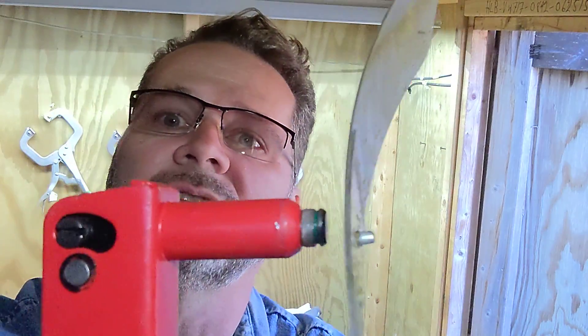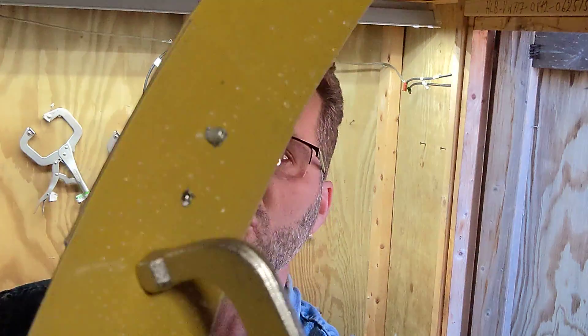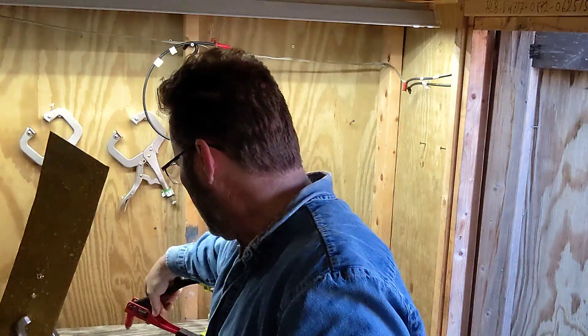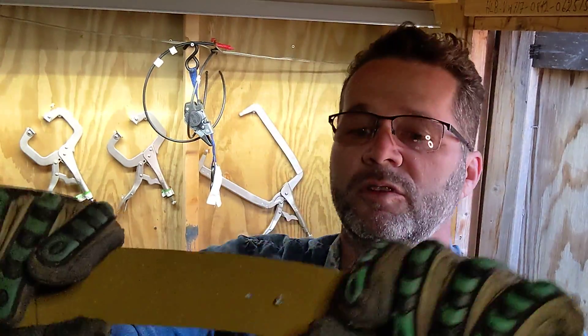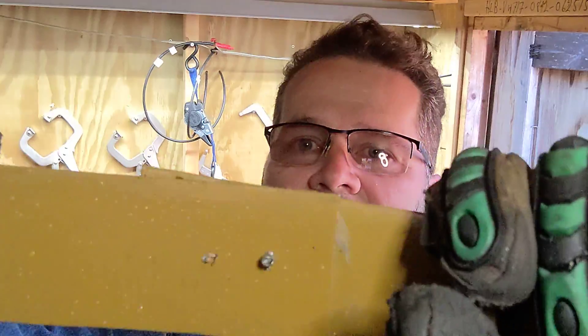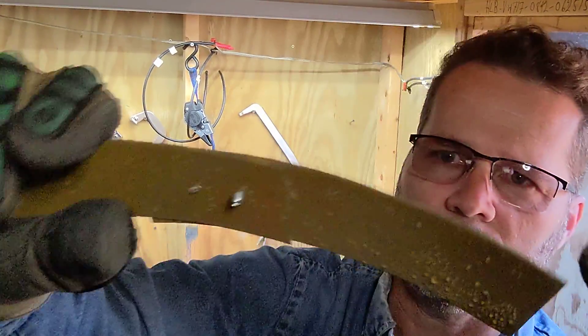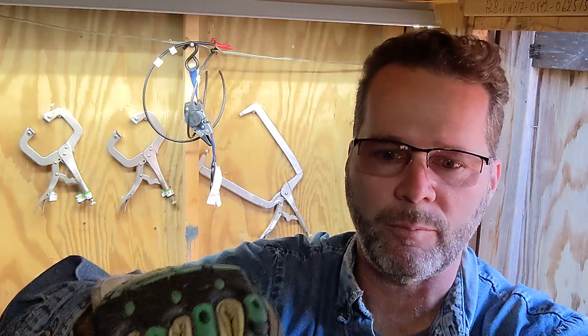That is now deformed and has bonded these two pieces of sheet metal together. I'm going to glove up because it's sheet metal — you gotta be smart about it. That bond right there, you can still pivot and rotate it, but they're tight together. We're talking about a shear strength pulling apart across — about 250 pounds of force to snap that.